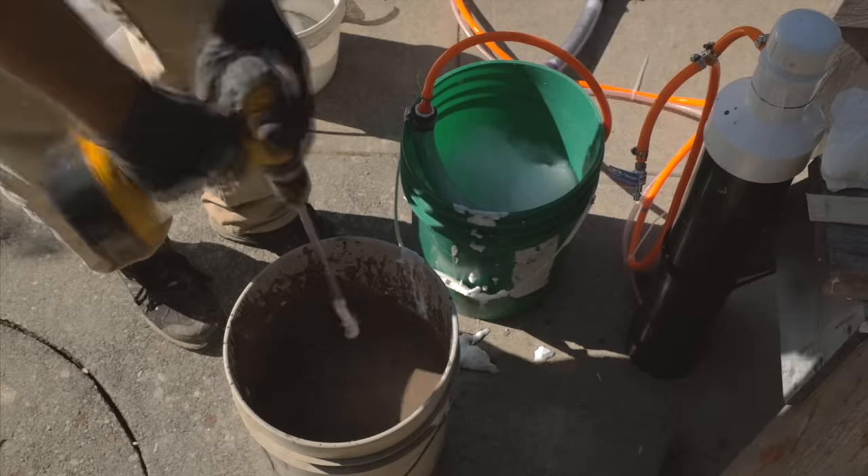When the aircrete solidified that afternoon, I covered the forms with plastic and left them for a couple of days. I remove all the screws from the form, gently wiggle the sides to free them, then remove the panel from the base and stand it on one side. And then remove the ends.